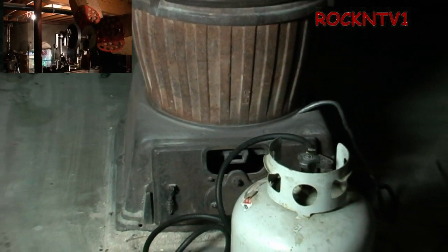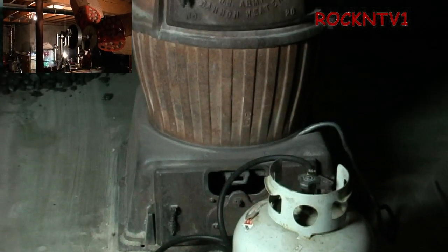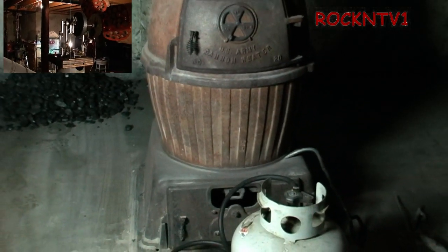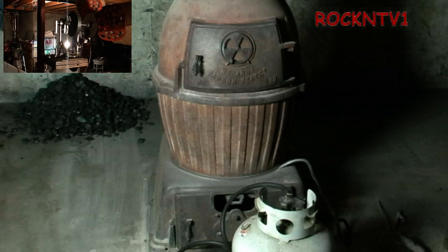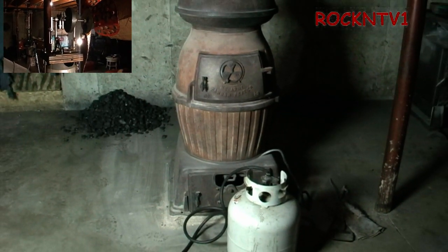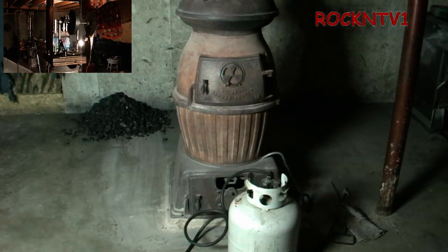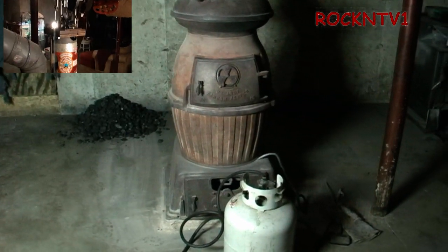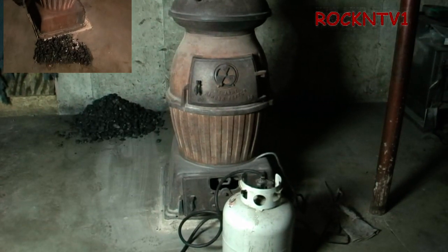You shake that little thing, but this stove is old and there's no replacing the castings unless I form them up and have them cast. So I do my best not to break them, which means I use a technique called slicing — I use a very thin poker and go down through to open it up so it burns, and I don't have to beat the shaker grate because she is old.